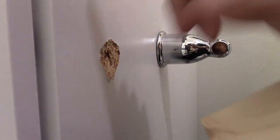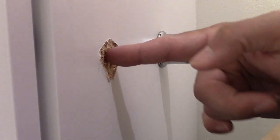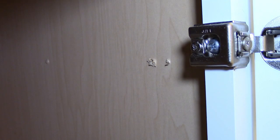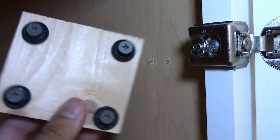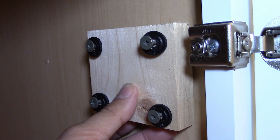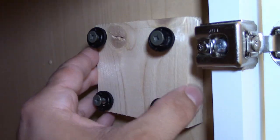I'm going to show you how to mount this on the inside of the cabinet. A good thing to do is pre-drill your holes on the corners so you know where they are and avoid alignment issues. I drilled a hole through it — if you want to do that, just put a longer screw in your existing hole and drill through so you can see where it comes out and line up perfectly. Inside the cabinet, I'm taking off anything that protrudes. I went ahead and attached the screws — you could also use adhesive like caulk on the back, but four screws is more than enough. I'm going to go ahead and install this.